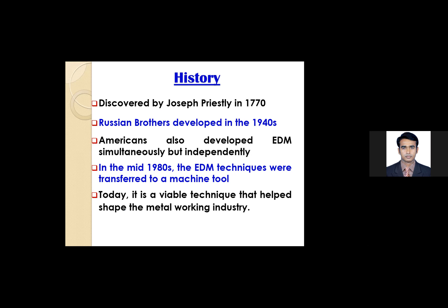They could not be successful in their research, but the byproduct was they found that if they put this tungsten contact in a dielectric medium — dielectric fluid — the erosion of that tool could be controlled. They discovered this is a new machining process in which we can machine hard materials that are difficult to machine through conventional machining processes such as cutting, drilling, or milling.